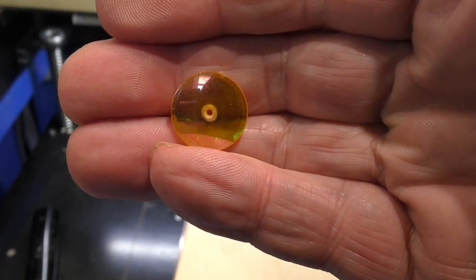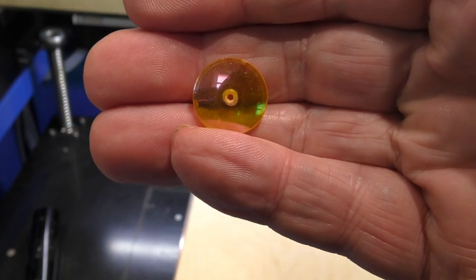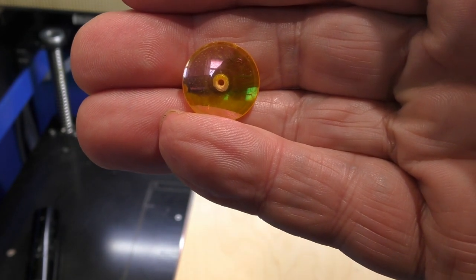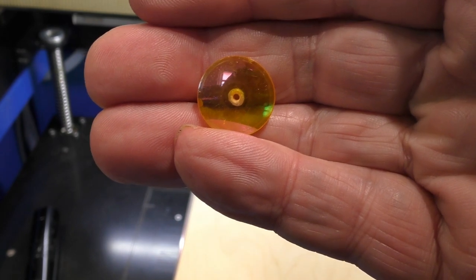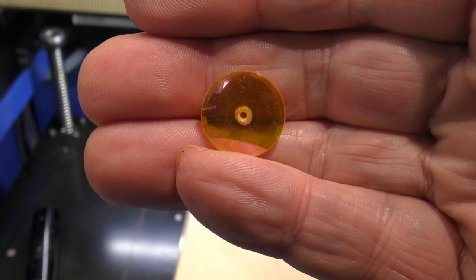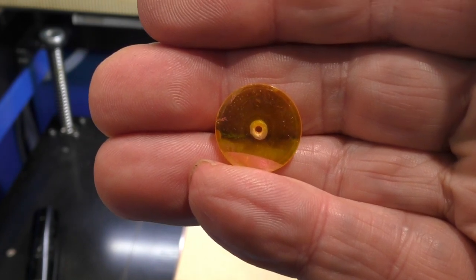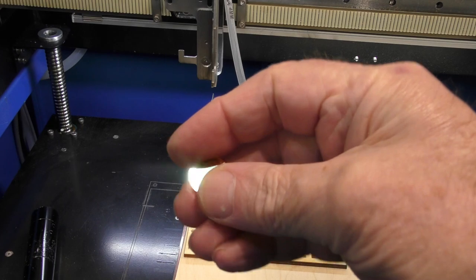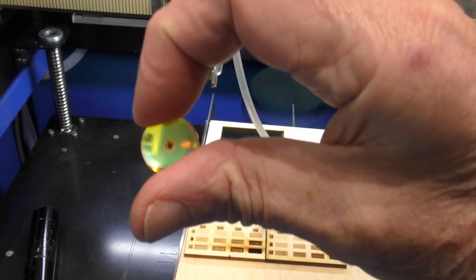Cutting takes place right down the center of the lens. Remember those red rays that pass right through the center of the lens? I've taken them away. I've stopped them doing their cutting job. And what I've got around the outside is the bit that does the engraving. Now, you may not believe that, but hey, the evidence is in front of your eyes. I'm just trying to give you some facts. I understand a lot about lenses. I've spent a great deal of time, as you can see, investigating lenses and how they work.